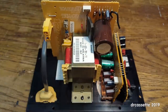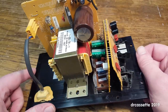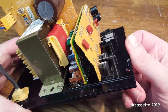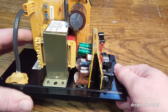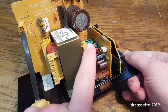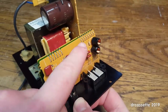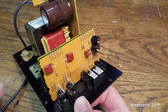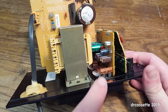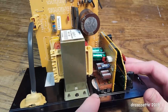The items up here seem to be related to the power LED that connects right there. The actual amplifier is a real work of art — they split the circuit board into three sections and joined those together with wires, so they were able to wrap the amplifier board all around. This right here is the main amplifier board. On this board we have filter networks for the inputs and output, and right here are the input and output connectors. Rather disappointingly, it's really difficult to take this apart. The amplifier is using two ICs, one IC per channel, and those ICs are sandwiched in between the heatsink and the back.